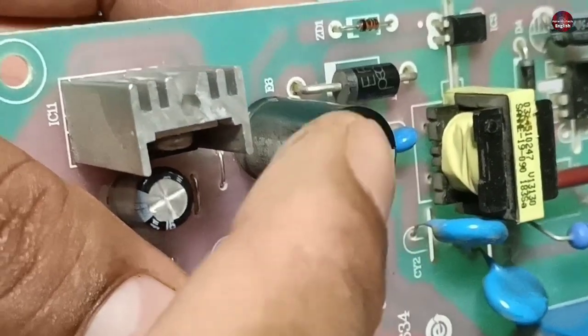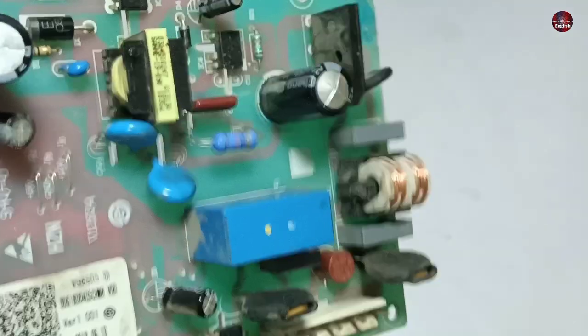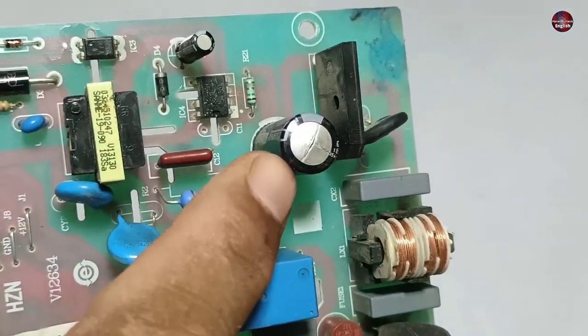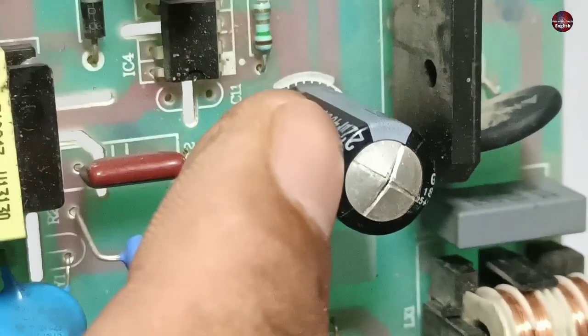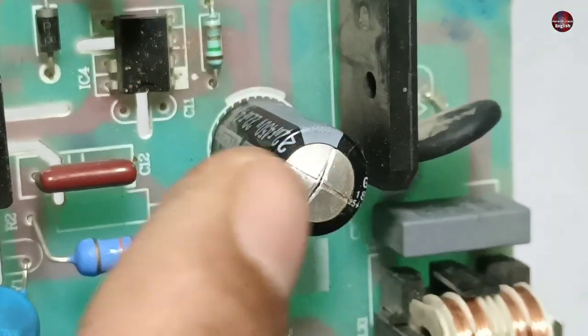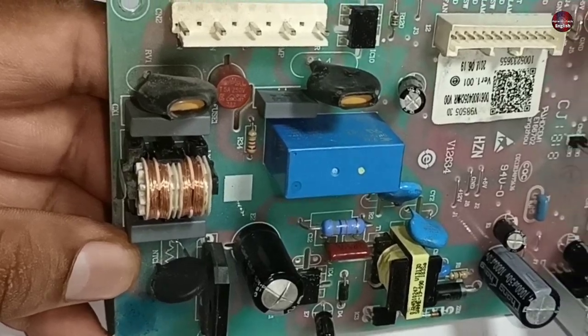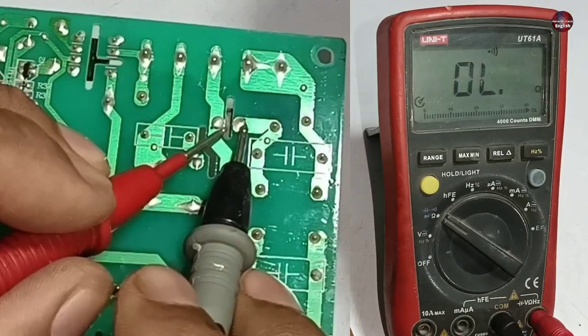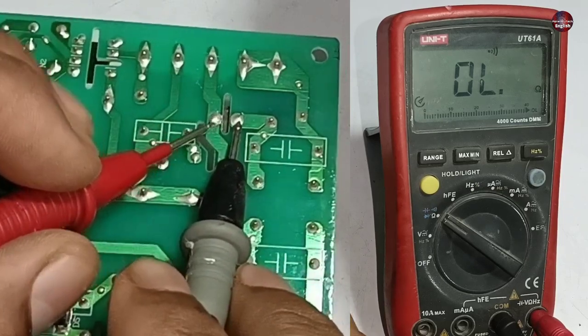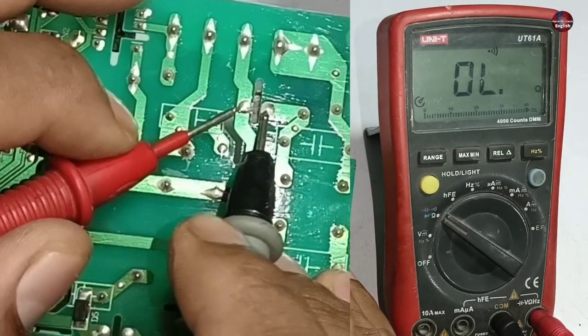But the front side of this power board has a problem. You can see this capacitor over here is flat, but this capacitor installed with the SMPS circuit has been bulged up. If this capacitor has blown, it means that any other component in the motherboard could be faulty. The first component to check will be its fuse. The fuse of this motherboard is not beeping on continuity, which means the fuse is also bad.